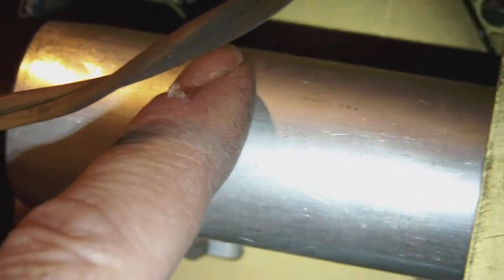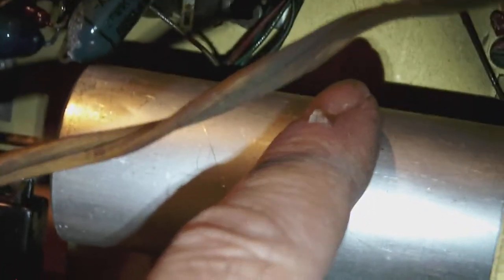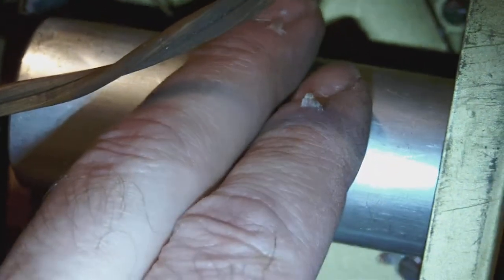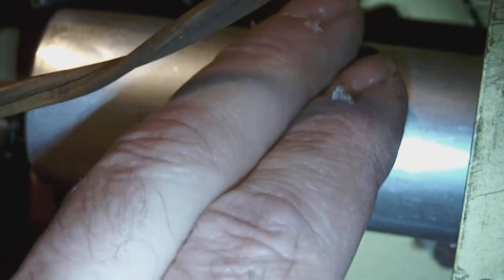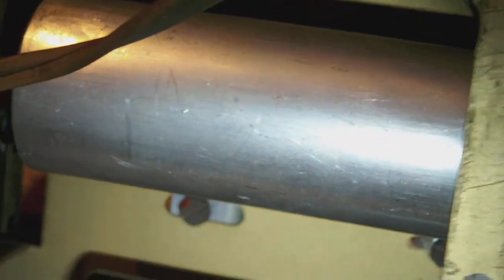And I wouldn't be too far off the mark if I would say that it was this big electrolytic, which started to smoke. Yeah, I wouldn't be astonished that this was the culprit, or the source of the smoke. Because as you all know, electrolytics are infamous for shorting out after quite a few years of being used. So let me turn the chassis back to its original position, and let's have a look at the power transformer.